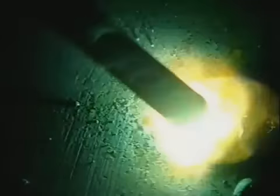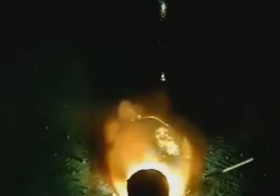If the amperage is set too high, the puddle is agitated and extremely fluid. Little balls of metal might dance off to the sides, causing excessive weld spatter. When the amperage is about right, the slag solidifies back from the rod. The sides tie in, and you can ease the puddle side to side.